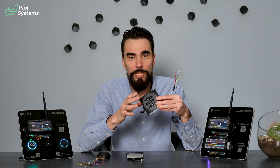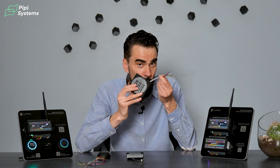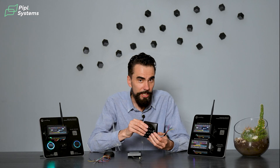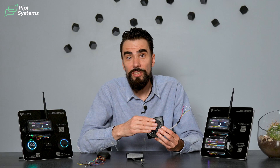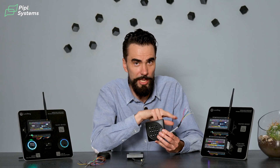Wiegand has a lot of advantages. One of them is that this is a one-to-one connection — one cable goes to the port of the controller and that's it. Though there is an inherent problem: automation and industrial systems sensors don't need security, and there is no security here. You can actually connect to this cable and see what's passing through it.